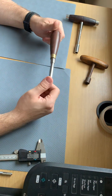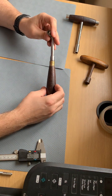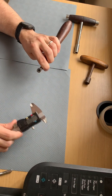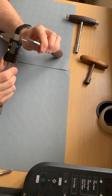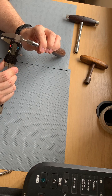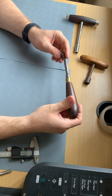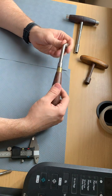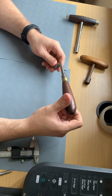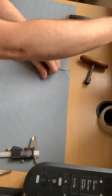Now here's a quite old, well, I'll say it's old. This is made by GF Baker again. This has got an oval shaped hole. That's just over 6, the widest part there, 4.4. And this is probably for really old square pianos that may have had pins this shape. It may also fit oblong pins, small ones. So a nice little thing to have, could be useful. That's that.